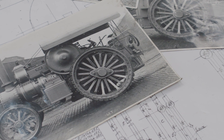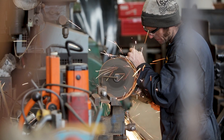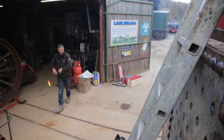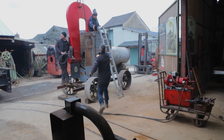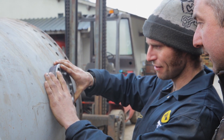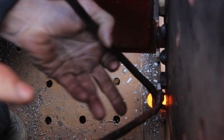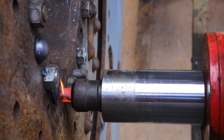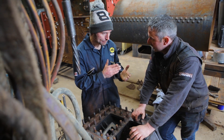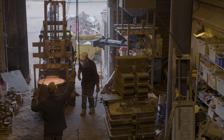With the plans now in place, it's time for Alex and Guy to start the Herculean task of manufacturing all the individual components of Talisman, which once completed and assembled will transform into the iconic shape of this famous road locomotive. Some of the components, like the boiler, the belly tank and the tender, are still fabricated and then riveted together, whilst the main cylinder block is more complex and will need to be designed, prepared and then cast.